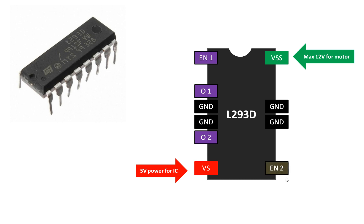The second gate has another enable pin at pin number nine — EN2. If you give five volts to EN2, only then outputs O3 and O4 get enabled. O3 and O4 are gate two — on the right of the IC is gate two, on the left is gate one. You can use only one gate if your application requires it. For gate two, you have to give five volts to enable pin two to enable O3 and O4.